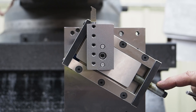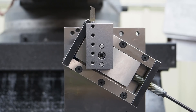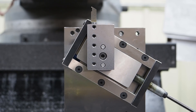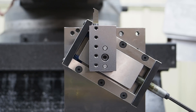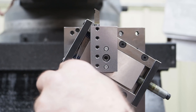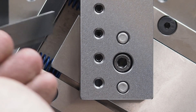I went with a half-20 thread because I wanted a nice footprint and a little bit of power if I needed it. With a 20-pitch thread, for every full revolution I've wound in 50 thousandths — if working on the diameter that's 100 thousandths — so I can just track the counting. For rough work I can always mount indicators on here for even more precision. I've also made this unit so I can put feeler stock, gauge blocks, or whatever I need inside here.